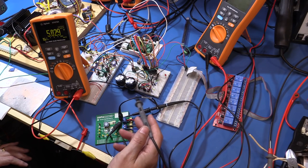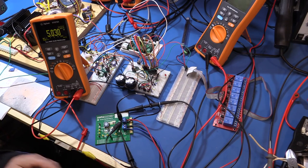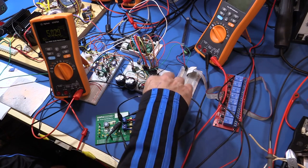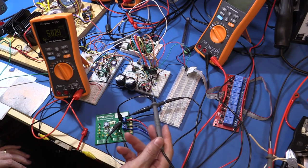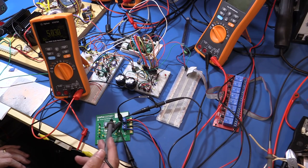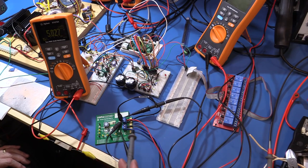The big grounding leads here are going to be acting a little bit as an antenna, but we're not looking at RF or anything like that, so it shouldn't be too bad for interference. Any ripple we're going to see is probably going to be at the switching frequency. There should be a test pin that will show us the switching frequency. I've put the jumper in to set the output to a nominal 5 volts, and we'll also try the 3-volt output. We're going to monitor the input, comparing it with the output ripple, and when I vary the input on the Keithley power supply, we'll see what output effects there are.